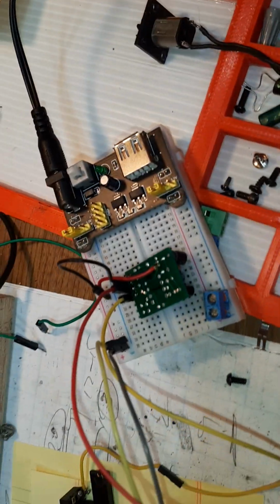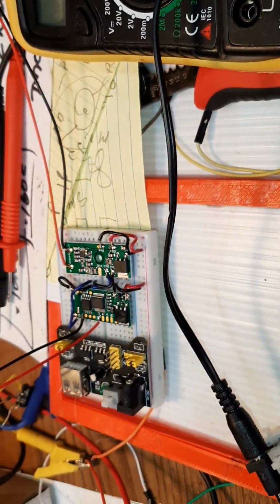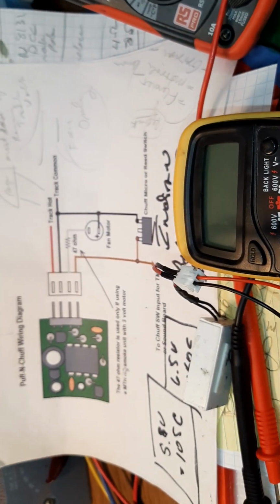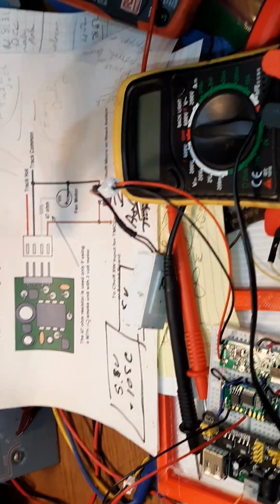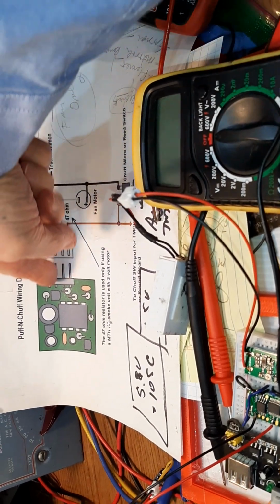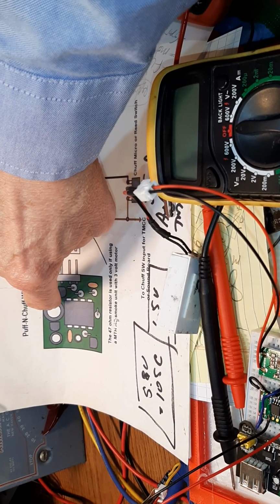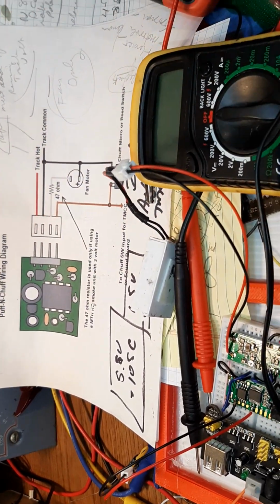Okay, this will be interesting for you. There's the sound circuit. This is the diagram for the puff board, and he's showing you in a sort of a cartoon what happens, but he's bringing in track power. But the track power goes through a diode, a capacitor, a 5-volt regulator, another capacitor, and then it goes to the chip. I flipped this board over and I traced the circuit.